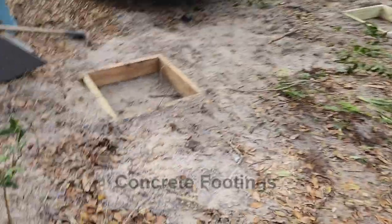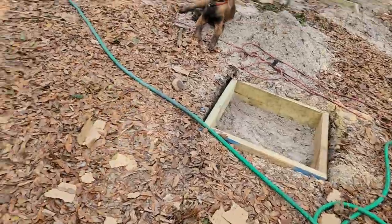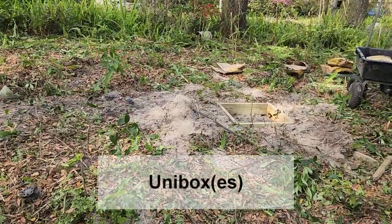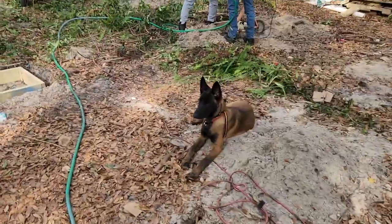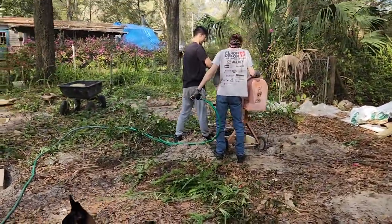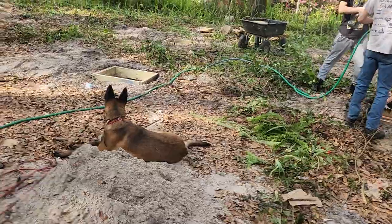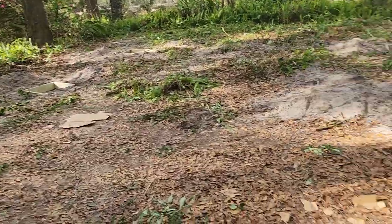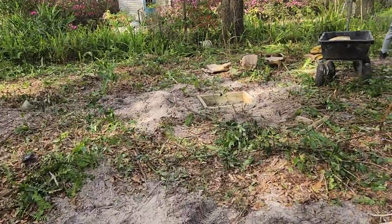The way we're going to do that is just go ahead and put these footings in right there, and then we're going to build basically beams and stilts to hold up the shipping containers — which we now call muni boxes. The guys are getting ready to mix some concrete and fill these in. These are two foot by two foot by six inches deep, and this should be more than enough to support the two units we're going to put on those.